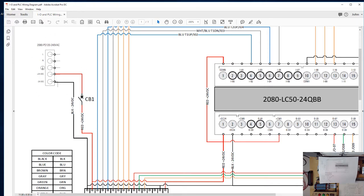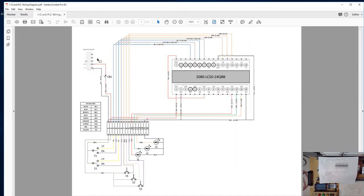You'll have a copy you can download and have open on your computer while you're wiring. Up in the top left we have the schematic representation of our power supply. The line, neutral, and ground are already connected to your power cord, so you don't need to do anything there. Coming off of that we have our red wire going to the circuit breaker — we did that in the last video. Then we come out of the circuit breaker down to terminal block 2, and jumper from terminal block 2 down to terminal block 16. The negative supply comes to terminal block 1 and is also jumpered down to terminal 15. We've got the PLC up in this corner and all our devices down here, along with the color code to help you with the abbreviations.